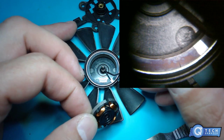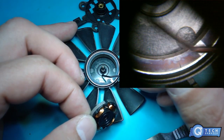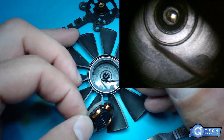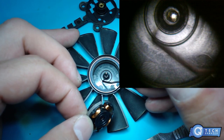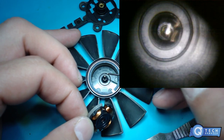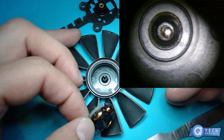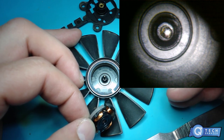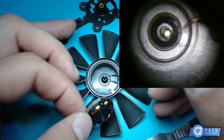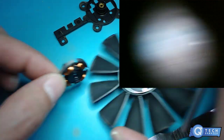See? After this, we'll cut this fan video and make it its own video. Separate, so people can get a shorter video. So you can see, there's no grease here, right? There's nothing there. It's dry bone. There's no grease on the shaft. Nope, it seems like it all just gets pushed forward, away from where it should be. It was in that bearing, but very little grease, all at the top. Doesn't even look like there was ever grease there on the backside.